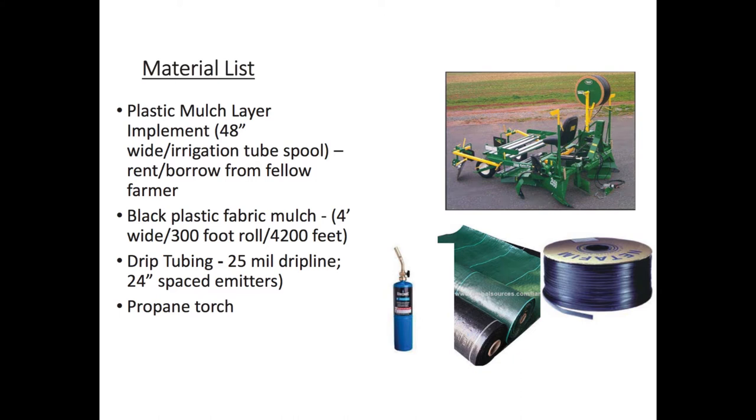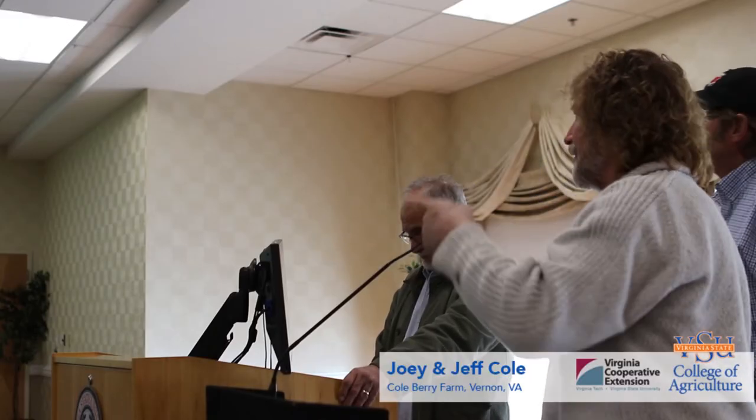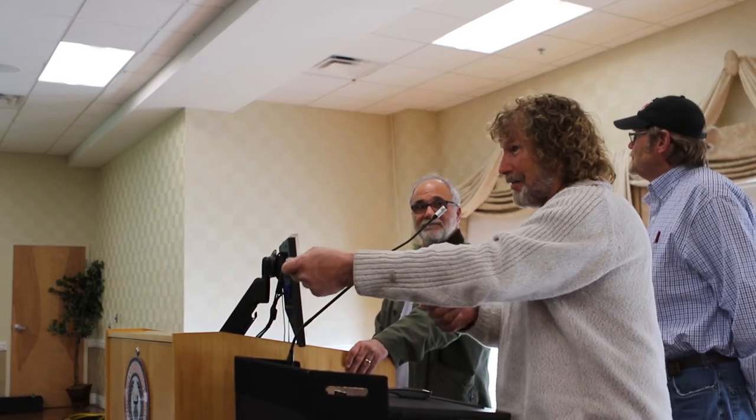One thing about the drip line — it's not T-tape, but the drip line. We prefer using hard ram line, something that lasts longer and rodents don't get into. But the 25 mil is the biggest that will go through this machine, at least the ones that we use, unless you want somebody out in front of the tractor trying to hold it into place. This line goes through the pipe and you can adjust it to either side of the row. You can put it on the surface or six inches down. That's the reason we use that particular drip line.